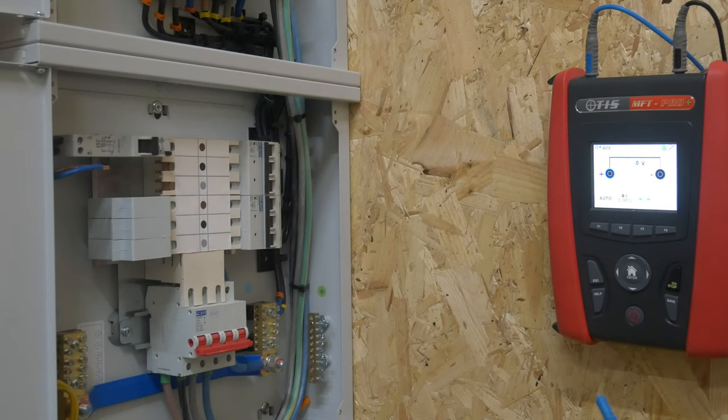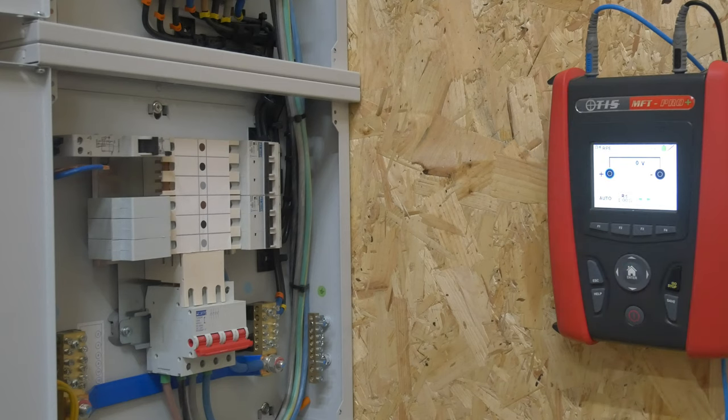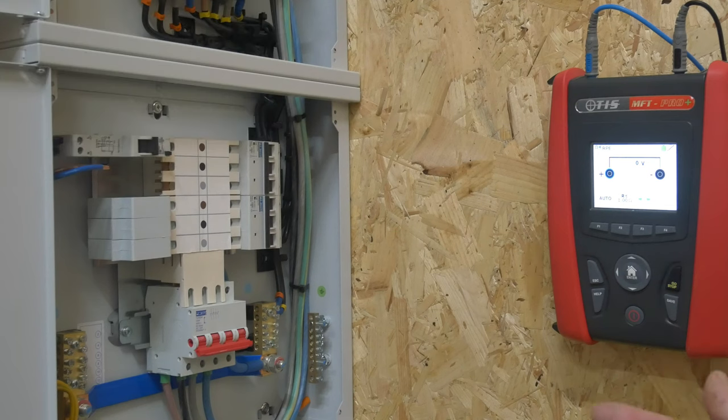Now with this one we need to make sure our continuity of conductors is correct and we're going to pretend I've brought this circuit straight down into this board. There is an isolator switch up there but we'll ignore that. I will pop a picture up here which shows me shorting out the cabling at the origin. You could do that at either end because essentially we're just testing this final circuit rather than the whole installation, and that'll make more sense when you see us doing the insulation resistance tests.